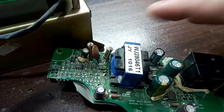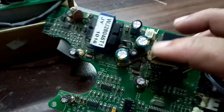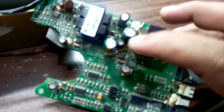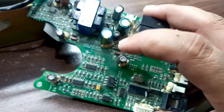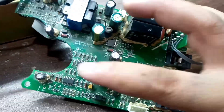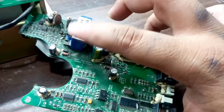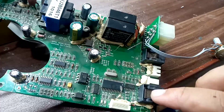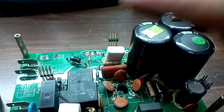This is a high-frequency transformer. The high voltages come over here, and then the DC voltages are further stepped down to 12 volts, 14 volts, 5 volts — whatever the voltage needed. These voltages power up the ICs and also go to the upper console to drive it. Our problem is with this card because it is not driving its MOSFET.